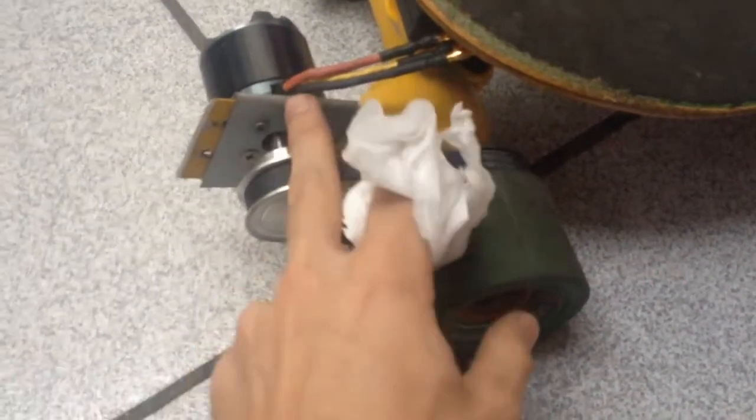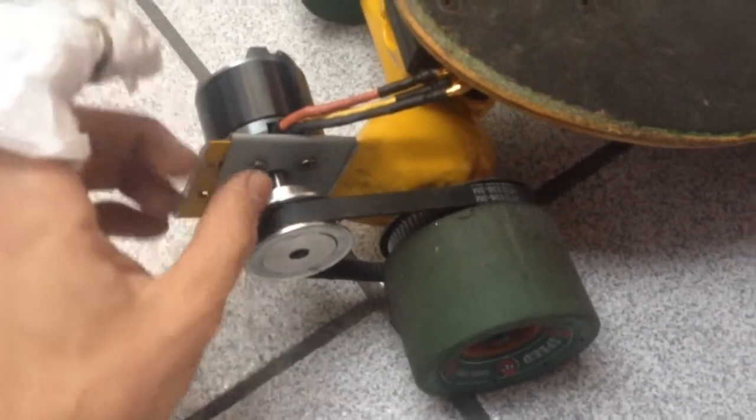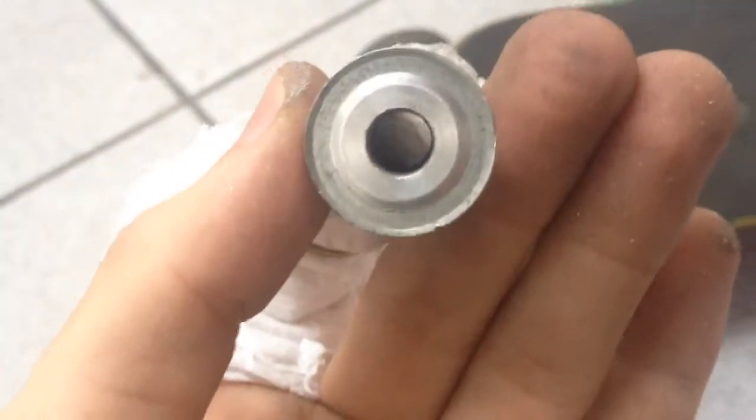So I did make this leaf so I can't put it inside there. And when the bolts come out, the crack will be just here in the middle, so I think it will work for a little time. But the little one is a 20-tooth 3M and it is offset — when I drilled it, I just didn't do it properly. I put it on the ground with some vices and drilled it, and the hole didn't get perfect. When it spins, it wobbles a lot and causes things to bend and crack. Too much wobble because it's not a centered hole; it causes vibration to break the aluminium plate.